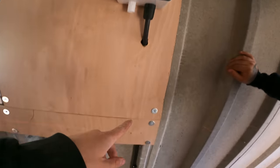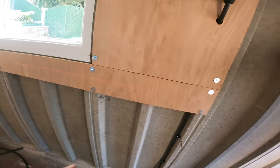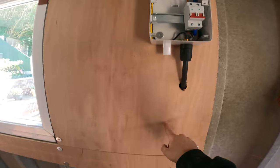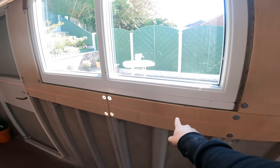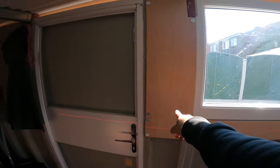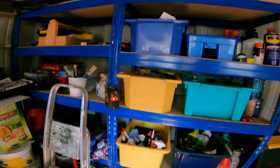Armoured glands in. Cleated down there, through. Left a loop outside so they can bury it when they come to doing the driveway. Conduit's just going to come out of there, bend, put a socket there, socket there, light switch, and then up. Laser set up there - that's going to run right through the centre of the conduit.